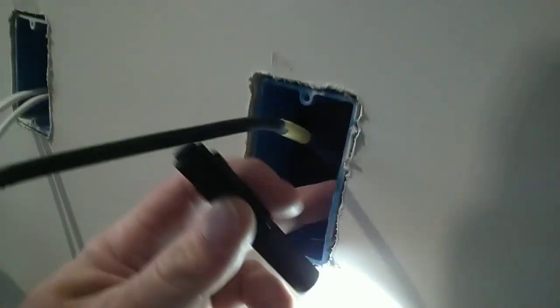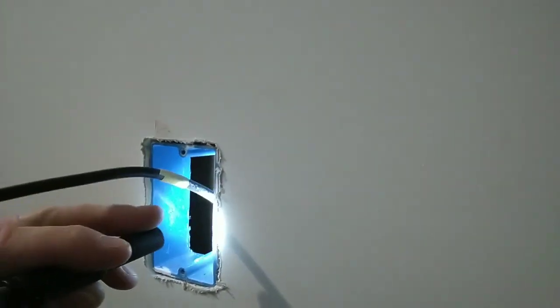See if I can show you what this looks like. You can see that I've cut the back side out. I've left a little bit of stability because you got to figure there's a nail at the bottom and at the top of this box that supports it to the stud where it's nailed on. So you don't want to cut it all out, but enough that you can get the cabling in. So get you set up on the stand and proceed with some measurements.